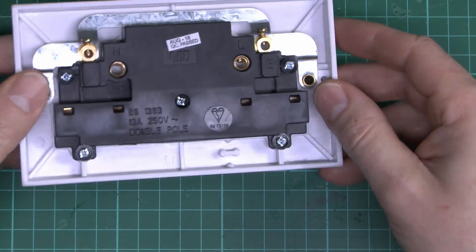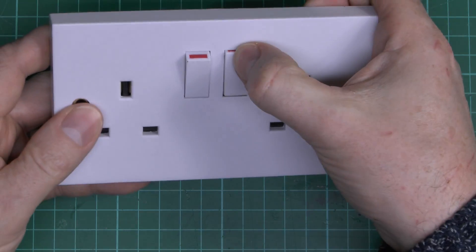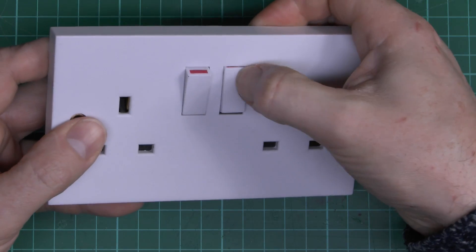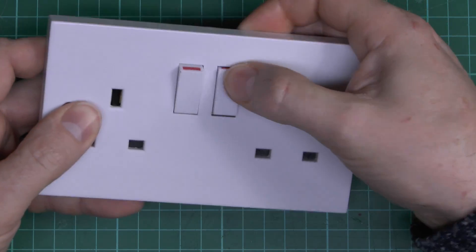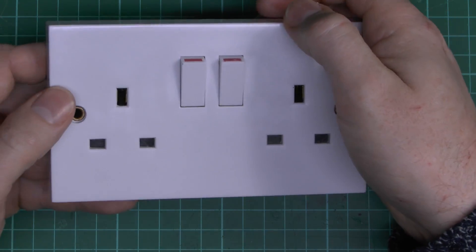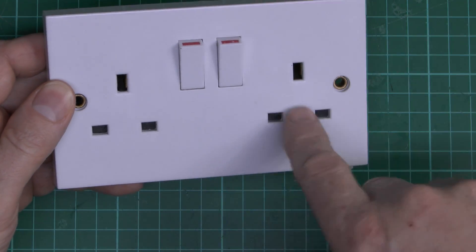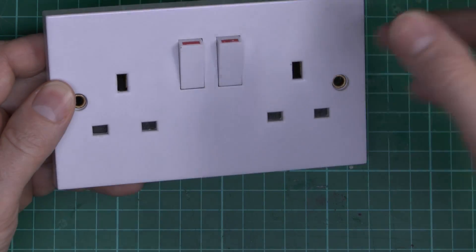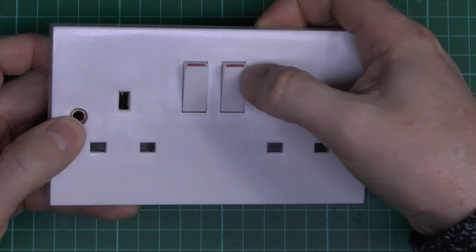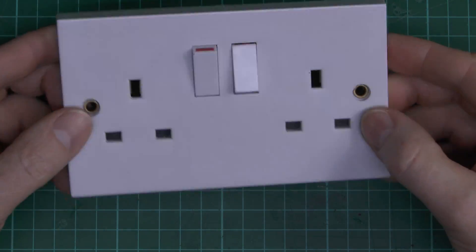The problem with this one is that the thing itself looks perfectly fine and normal, but in terms of the actual switch, this one here has a sort of gungy effect there, and it doesn't essentially turn off most of the time. This side is perfectly normal. And even when these are both in the on position, neither of these outlets actually works correctly, so at least one of the line or the neutral or both has failed in some way.